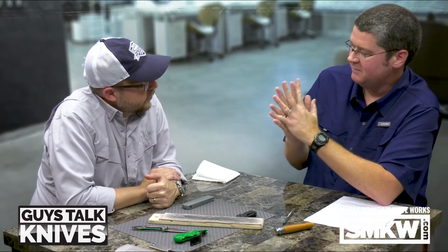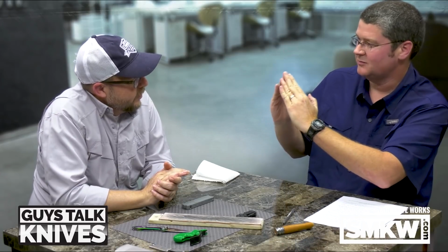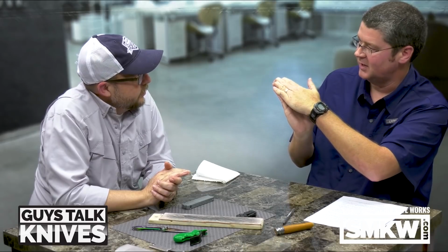If you're looking at the edge, depending on your steel, depending on how it's ground, the edge is not actually a solid edge. It's little fingers of metal. The absolute first thing that happens when you're using your knife is those fingers curl over. Next, the gross point, the actual point where it's metal meeting metal, will start to curl to one side, and that's when you can actually feel it. Now, if you keep using the knife at that point, you will dull the knife, and again you'll have to start over from a rough shape. But what you can do is hone the knife instead. Honing is actually straightening that curve and polishing the edges.